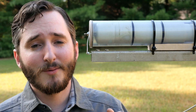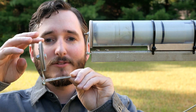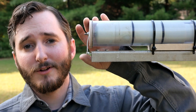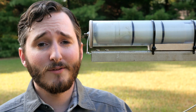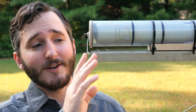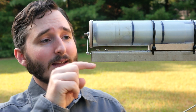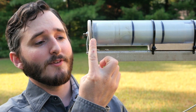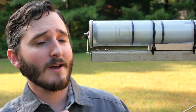In those same comments there were also a lot of suggestions on how to accomplish this, because the main issue is if you mount the valve upside down it doesn't want to hold against the barrel — it will want to fall backwards too easily. There were suggestions to hold it closed with a latch or a string, but I thought those were too complicated. The best suggestion came from one of my Patreon supporters, who suggested I move the pivot of the hinge further outward. In the closed position the center of gravity pushes against the barrel, keeping it closed, but as soon as it passes the pivot it wants to fall open.